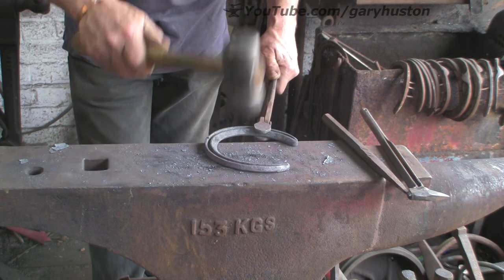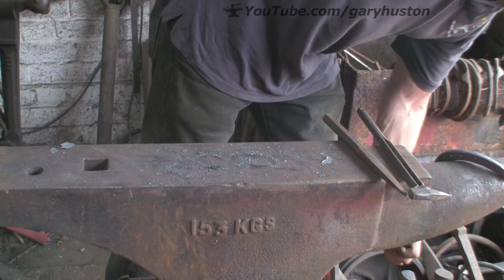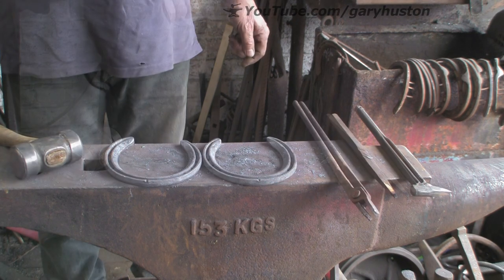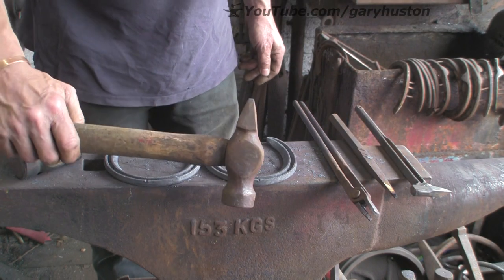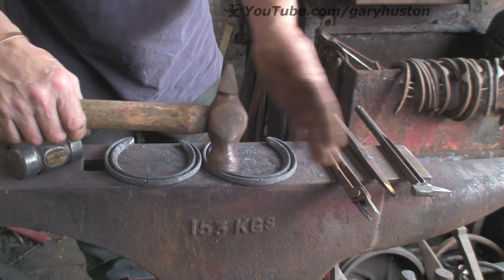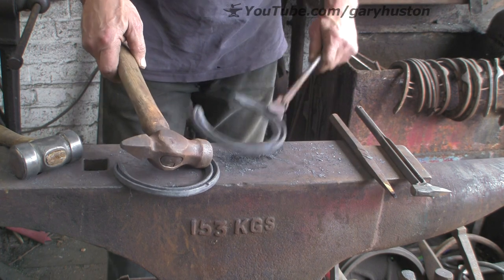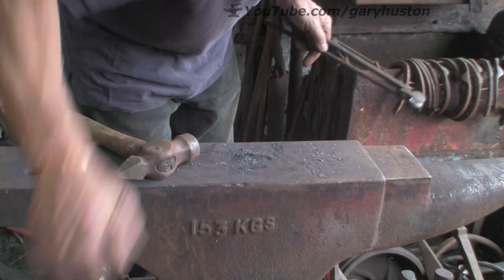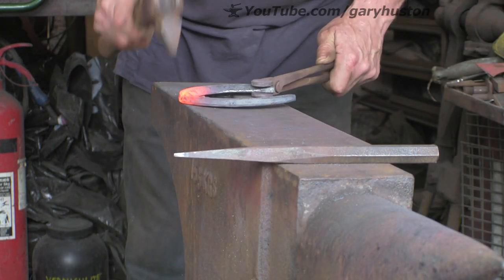The pritchel's not working very well — a few little nibbles on the back. Right, so that was the easy bit. Now we're going to clip them — put toe clips on these. What I'm going to use is this hammer, which is a modified ball-pane; I've drawn the ball out into a squarish rounded point with no sharp edges on it. There's a video somewhere — I'll put a link in the description — of making one of these. Get rid of all these tools; all I need for this is a back pritchel. You don't need it horrendously hot — if it's too hot it can tear quite easily.